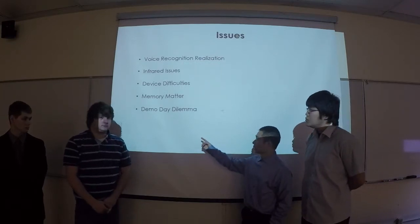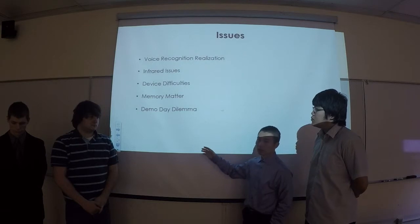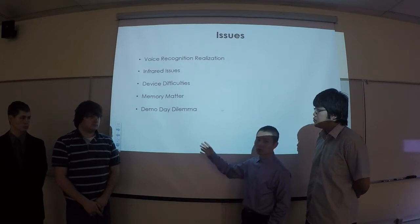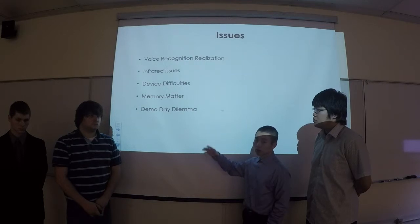At first we used the Uno, and we didn't have enough memory, so we switched to the Arduino Due, which has more memory, and then we realized that it doesn't have any EEPROM. Originally, when we were trying to store more than 3 codes, the processing got really slow, so we tried storing them in flash memory, which is also non-volatile. That means even if you unplug and plug it in, the signal is still stored in the board.